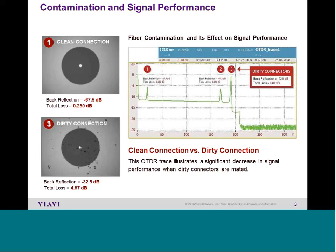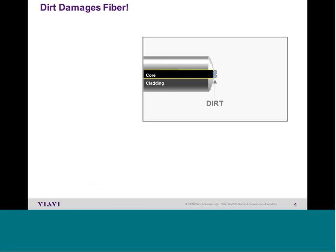In the upper left picture, we see the white dot in the middle is a nine-micron single-mode core, the gray circle is 125-micron cladding, and the white outer area is the ferrule. On the OTDR trace, connector one is represented by a low reflection and no loss. In the lower left, image three is represented by a high reflection and high loss — we see some dirt, but only two tiny pieces touching the core. We can get a fiber this dirty just by dropping it on the ground, touching our hand, or our clothes. This amount of dirt makes back reflections 30 dB worse, which is a thousand times worse, and we pick up 4.6 dB of extra loss.